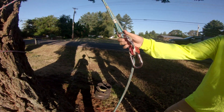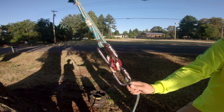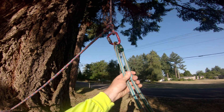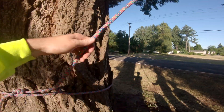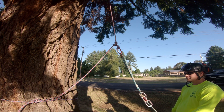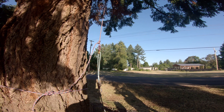All he has here is a double rope system he probably already uses. If you've got two climbers on your crew, you likely already have this equipment, and it only takes a second to add it to a base anchor. If you don't add this to the base anchor before you load it, you're going to have a really hard time attaching any sort of lowering system and will have to use a completely different aerial rescue procedure.